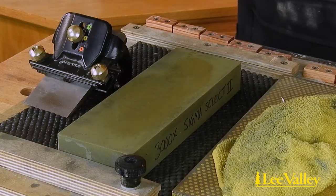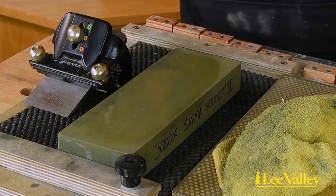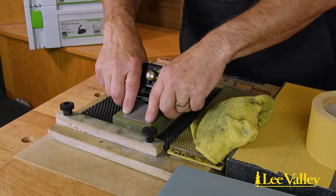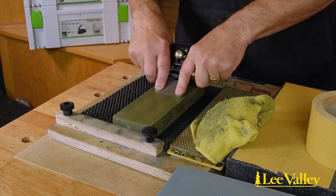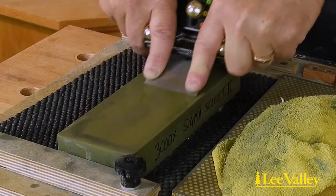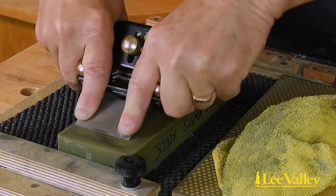The size of the grit to use is a trade-off with how long it takes to remove the scratches from the very coarse grits. For this reason the coarsest grit should be 80 to 100, and quickly switch into a finer grit when the bevel is close to complete. This will finish the grinding and remove the extra deep scratches at the same time.